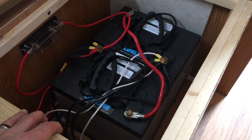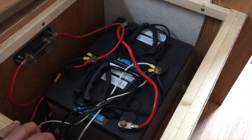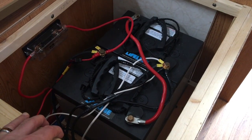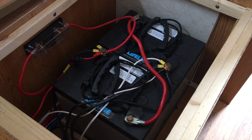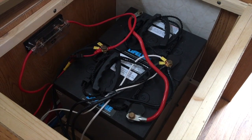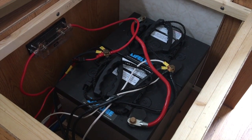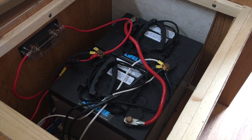I've been very happy with the Lifeline batteries — I've owned them now for about seven years across two rigs. The performance can't be beat. I've used them in all kinds of environments, from triple-digit heat in Arizona to freezing temperatures in the mountains of Utah and South Dakota. As long as you charge them properly and periodically equalize them, they'll last a good 10 years. Don't go cheap on your batteries — they're an essential component that captures all the energy your solar power system produces. Get fresh batteries for your rig so you know they've been properly cared for.